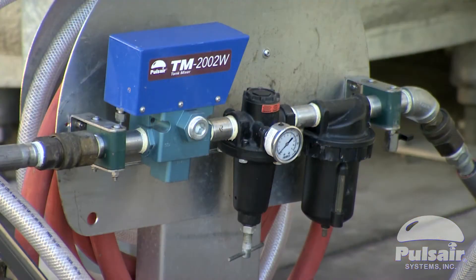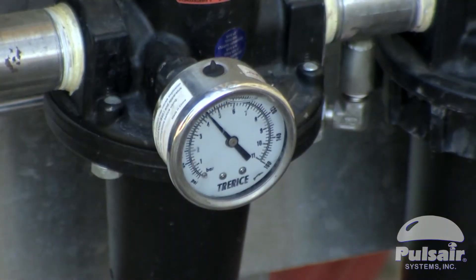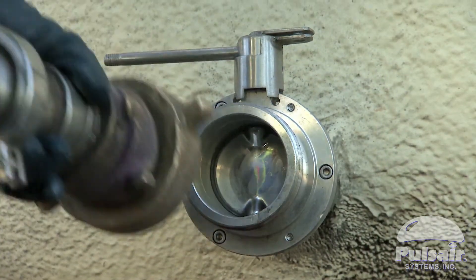When we add SO2, acid adjustments, or stabilizers like CMCs, and when you put a 200,000 gallon blend together, you worry about stratification that happens in the tank. But with this blending cart, you're able to hook up, get the tank mixed, and you're pulling an accurate sample.